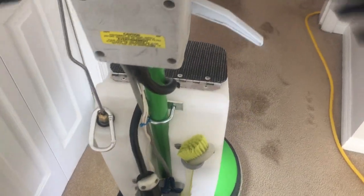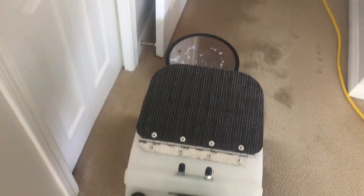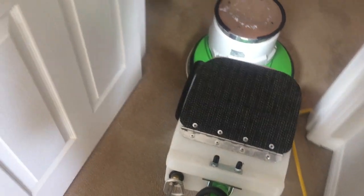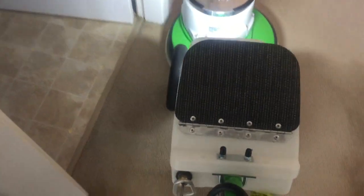Pull my slack. You see, back to the handle release, you notice that what I did is I kind of push it forward rather than grab and pull it back, because I've realized that what I'm doing is taking the tension off the little pinching mechanism in there. It's a very brilliant way they've got this working, but there's bushings in there sliding up and down a shaft, and over time they will wear. I did replace the pinch mechanism on this machine about 3 years ago.